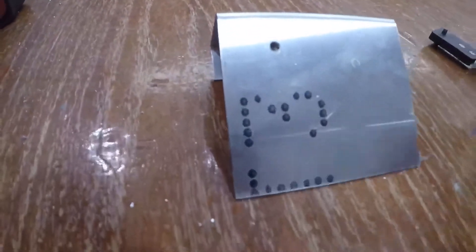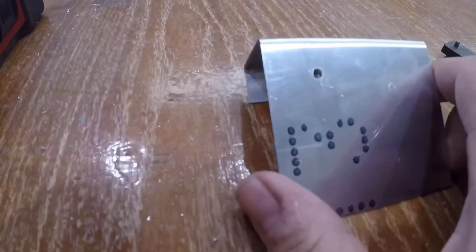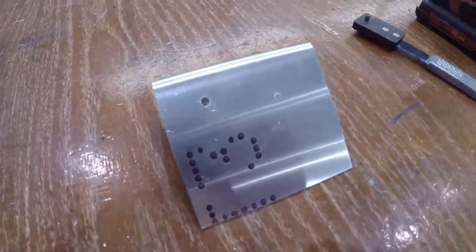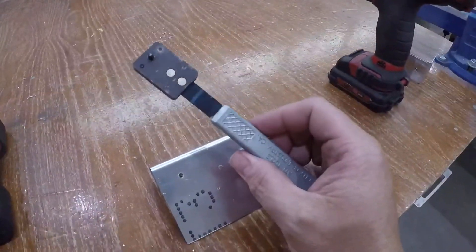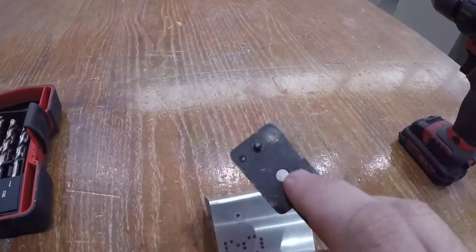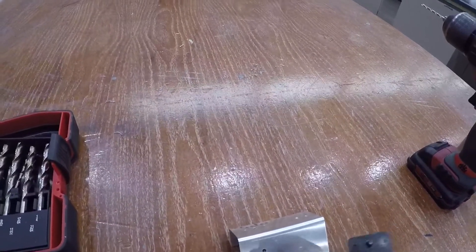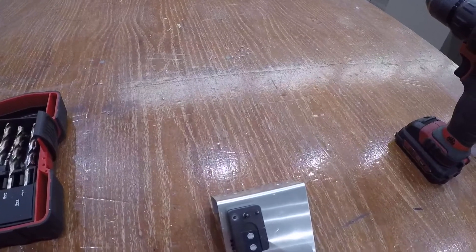What you want to do is drill a 9/64th hole. I have a 9/64th hole where I want my screw to go — let's say I'm making a nut plate for an inspection panel or something like that. I take this little tool here — this is a nut plate tool. The pilot on this side is a 9/64th pilot, so that's why we drill a 9/64th hole. Then I insert the side that has the one pilot into my hole.